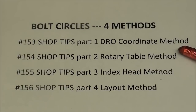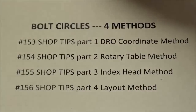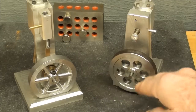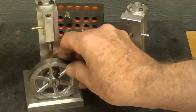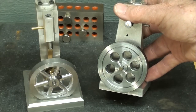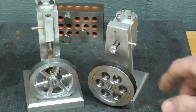We're going to use the rotary table method to do the exact same operation of locating and drilling six holes. These methods for bolt circles can be applied to virtually any project where you have a bolt circle, but this specifically was applied to my little steam engines. Normally I use a spoked flywheel, but since you won't be able to do that at home, this is another way of making little flywheels with a bolt circle to give it somewhat of an appearance of a spoked wheel and to reduce the weight on the inside, because the weight is only needed on the rim of a flywheel.